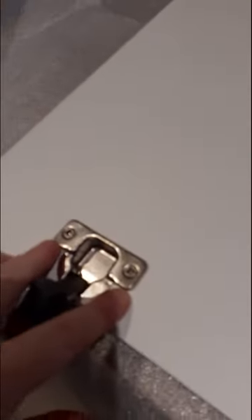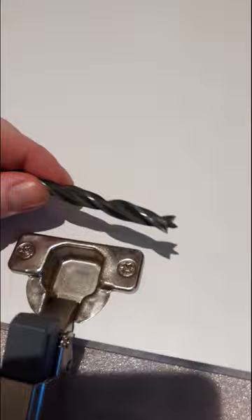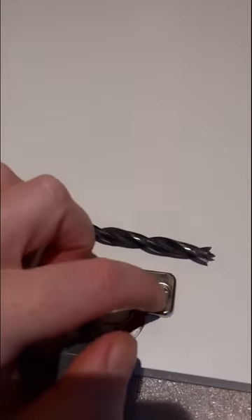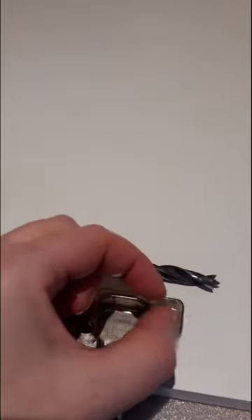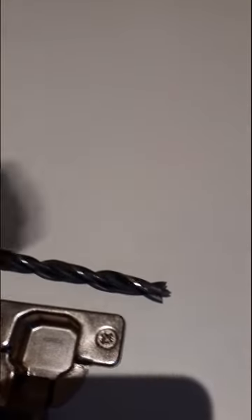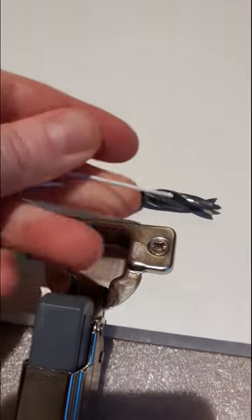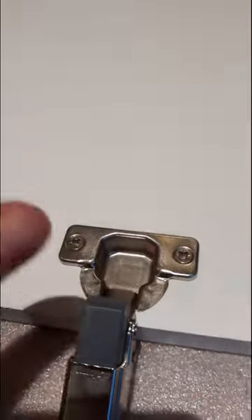These screwed in pretty easily. However on this one I did have trouble - when I used the 8mm drill bit to make the hole bigger you really only want to make it microns bigger. I went a bit too big, so when I put my screw in the dowel it was turning. What I had to do was use a paper clip and just put a little bit in the side to wedge it in there. That's something I'll remember for all the other doors.